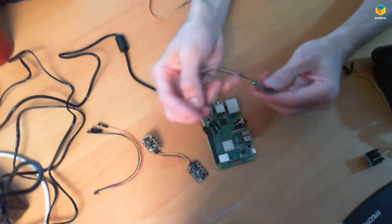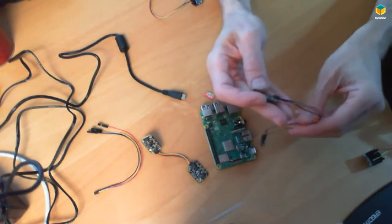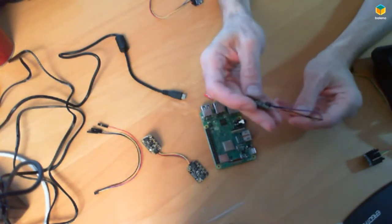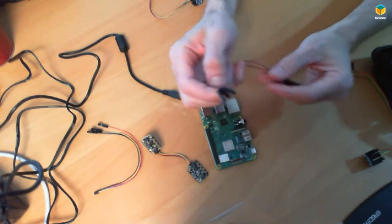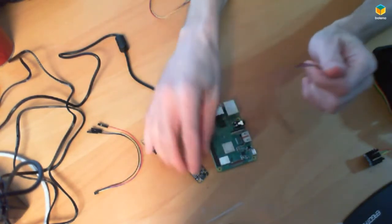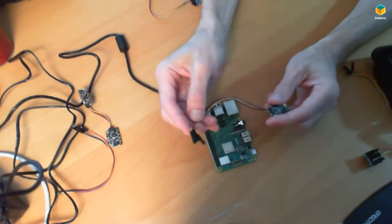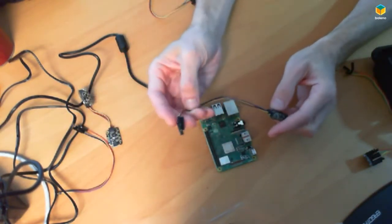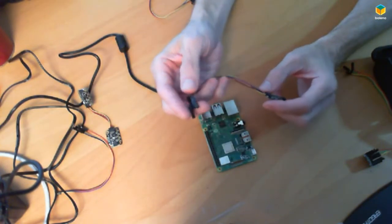But let's quickly connect. What do I have here? This particular sensor is the BMP280, and that is, I believe, temperature and pressure. So we'll see what the air pressure is here. And as far as connecting to the Pi, as I mentioned, this is a 4-conductor bus. So it's power, ground, data, and clock.